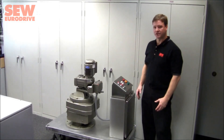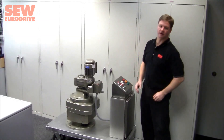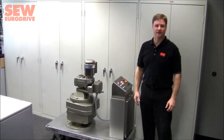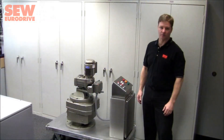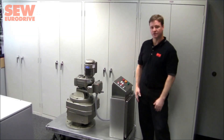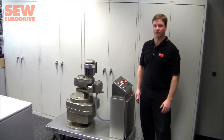This is a unique solution offered by SEW — a very flexible combination of multiple gearboxes combined with a mechanical torque output monitoring system. This design was originally put together for wastewater clarifiers, but can be used for any application where you need very high output torque combined with a relatively low output speed. It uses a two-stage torque monitoring system applicable to protection of both equipment and personnel.